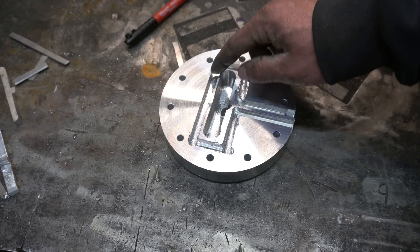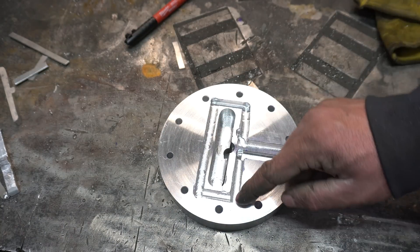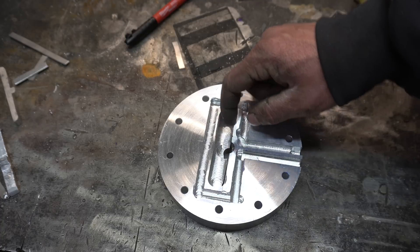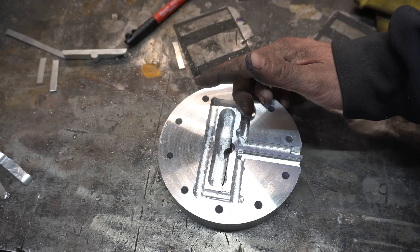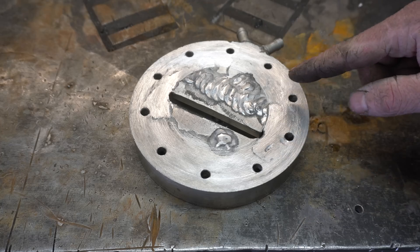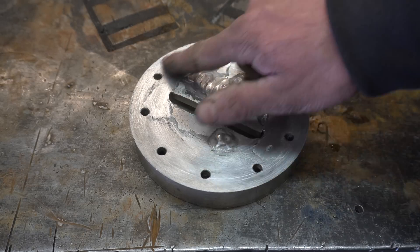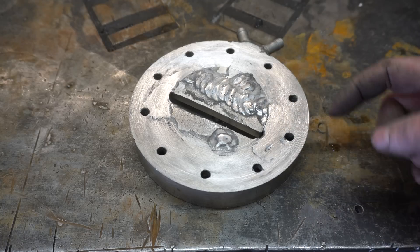I kind of free-handed this. I cleaned up the slop in my mill a little bit, so this went a little better than last time, but there's still some chatter in there. This monstrosity is the channel for the water, and I'm just going to go through and cap it with little pieces of aluminum and then machine the face smooth again. I welded this thing over and machined it down like a hundred times, man, and eventually decided to just get the part that seats on the gasket machined down and leave the blobs in the middle — because the blobs are doing some work. It's all sealed up and it passed the bathtub bubble test.